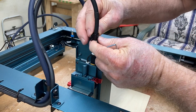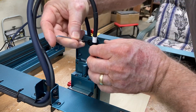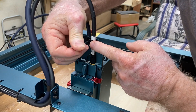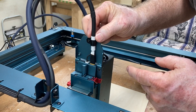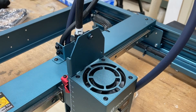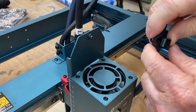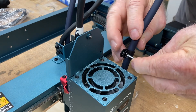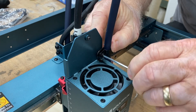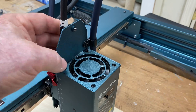There's one more small step — this is the little clamp that holds the cables in position. It just takes one little screw and the hole is pre-drilled and tapped, so just line up the little bracket and screw it in. There's one for the cable and one for the air hose. This air hose is attached on the front side of the laser head. Just clip it over the hose, slip your screw in, and screw it into the pre-drilled and tapped hole. I found it useful to use my own tool with a longer handle to screw it in.